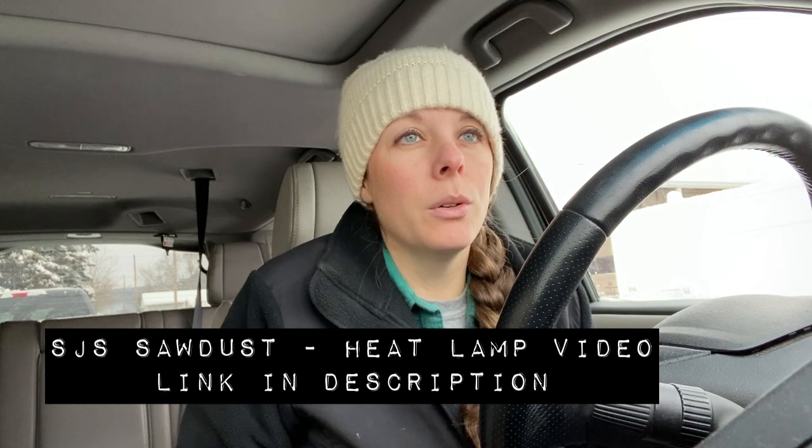Most of us know that water near electrical is no bueno. I did see some unique potential solutions to this problem. One cool YouTube video — I'll link it — showed basically building a small containment box around the control box and the Onefinity screen, and using a reptile lamp to heat that small area and keep it around 50 degrees using a thermocouple. That's an inexpensive way to potentially keep the temperature at a safe constant level. Maybe it'll be fine running it in 30-degree weather, but I'm not sure I want to find out if it's not.